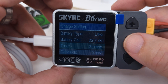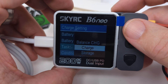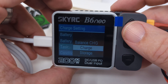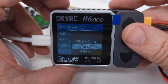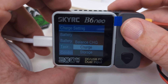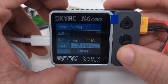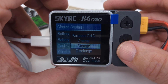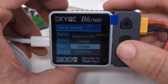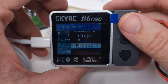Then you pick your task, which is your charge mode. It can do balance charge, charge, or discharge. Charge is just a quick charge where you can do it with just the JST plugged in — it's okay between rounds at a fight. I prefer to balance charge all the time because it's a better way to charge, though it does take longer. Storage mode is for when you're not going to use the battery for a month or two — it puts a lower voltage in the battery, which is safer for long-term storage so it won't damage itself. Discharge is if you need to discharge the battery for whatever reason.